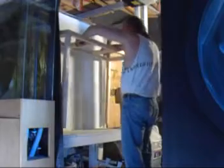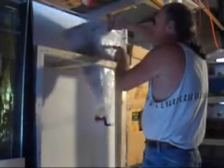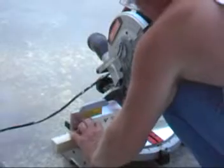With the basic framework completed, we're going to position the stand to make sure of three things. One, that the stand itself is fitting into the application. Two, that there's plenty of room above the stand so we can easily slide the hatchery or vessel in and out of position. And three, to make sure there's plenty of clearance below the hatchery so we can easily slide the drain containers in and out. With a few modifications, we'll now finish the stand.